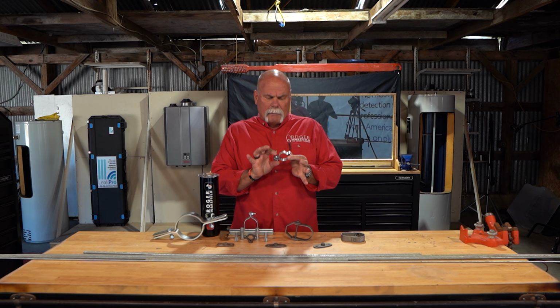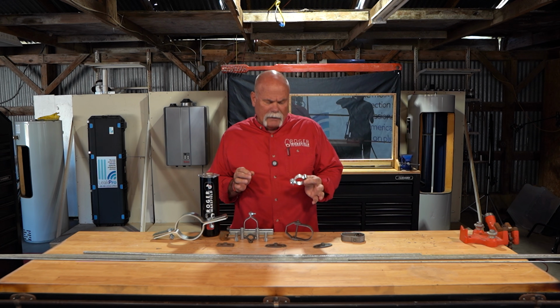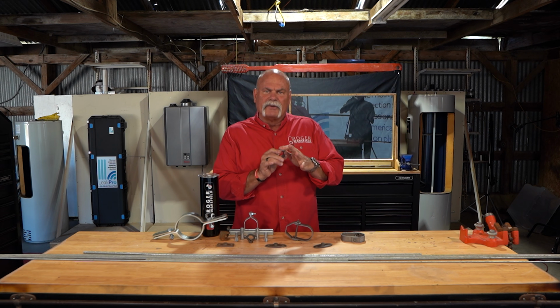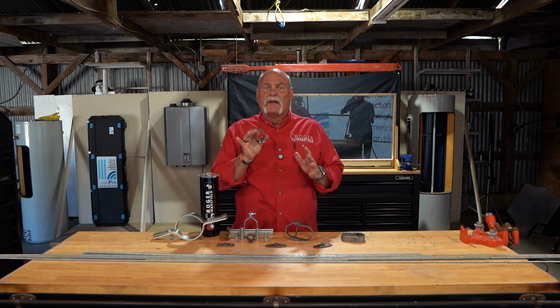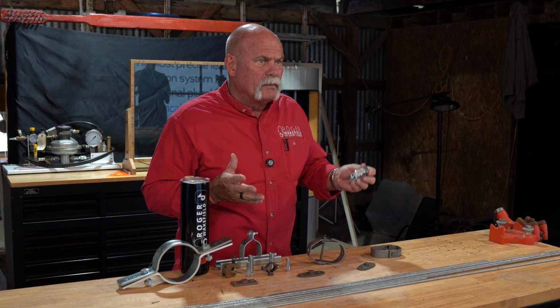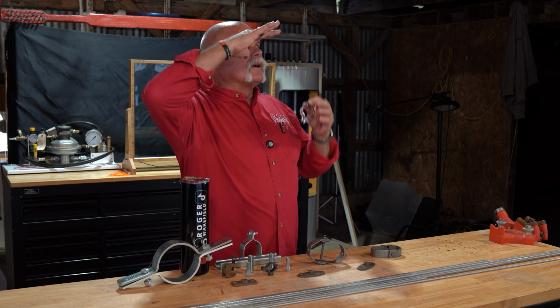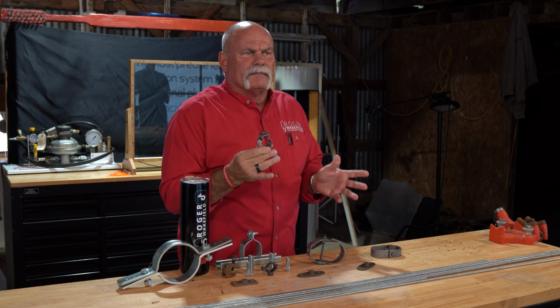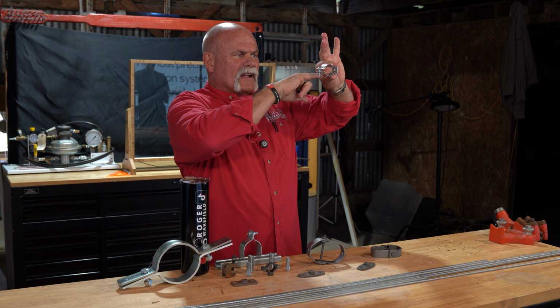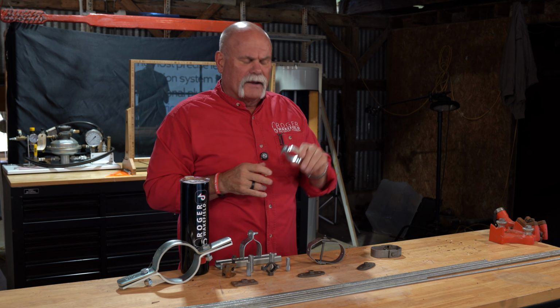First of all, this is a bolt closed conduit pipe clamp. Now, these are great because you can either mount these to a piece of unistrut or actually the bottom of a stud, anything like that. Now, depending on what you mount it on, you may not have any adjustment. If you're mounting on the bottom of a stud or a ceiling or even a wall, you'll know your BOP because you're going to measure off the floor, and that's pretty easy. You just measure there and mount it.